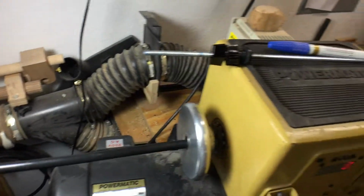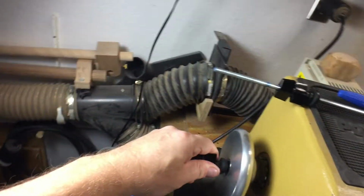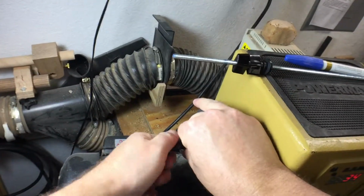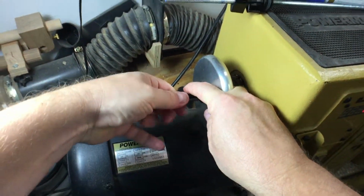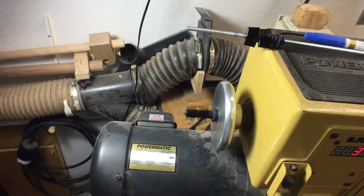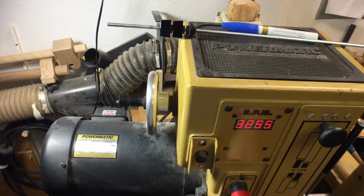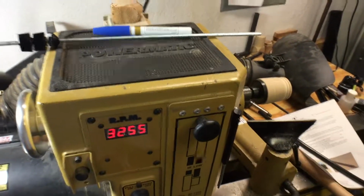Just like this one. Now that goes in there, engages, and the centering cone centers. We're not quite there yet, getting close. Tighten the one up, tighten the other one up next to that one. We don't have anything coming out there, so we're good to go. Now we can crank this guy all the way up. We have no fear of this thing coming out. I can work on that all day long and that Morse taper is not going to drift out of there.